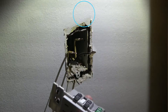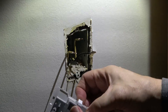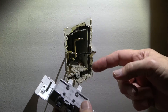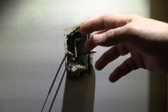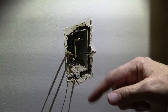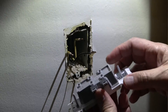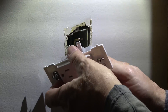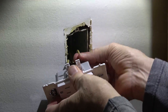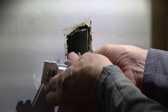With the insulation stripped off, what we do is open up the levers. Since I have a ground wire, I'll also include the green one. So you have white, which is your neutral, and black, which is your power or load. This is a pair and this is a pair. I'm going to do the two whites like this, two blacks down here — that keeps the pairs aligned, although it's not that crucial for this installation. And then we'll pick up the ground. It's as easy as just pushing the wires into the opening and then closing the lever for each one.